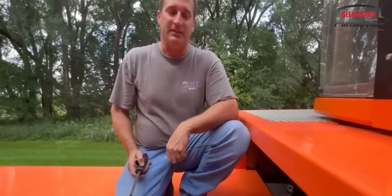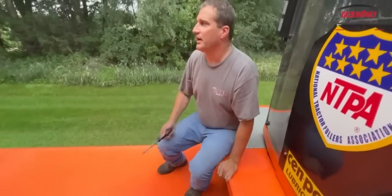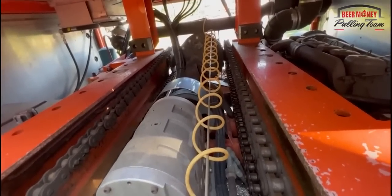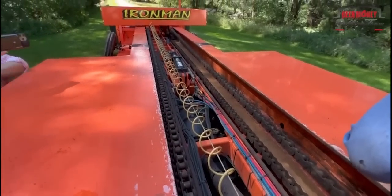So that's what a sled change is. That's a sled change in a very short, descriptive manner. But you can figure if you add a brick, depending on sled conditions, a brick or a weight is about 20 feet. Depending on sled conditions, a gear can be 20 feet. It just depends on how your track is and everything. And from there, we go back to a differential that has two sprockets welded on it that actually drive this roller chain. And the roller chain is hooked to the weight box. And that's what brings the weight box forward.